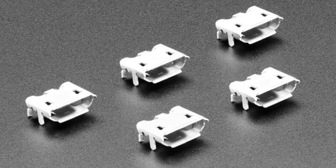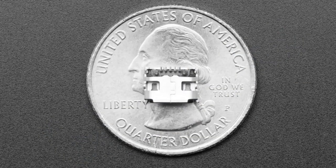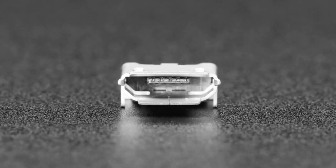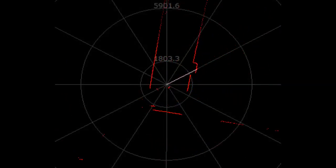You can use these in a surface mount process with pick-and-place — just put paste into the through-hole pads and it makes it super secure. I give Phil the boards after we make them with these micro USB jacks and say "Can you try prying this off?" He tries and it's hard — he usually destroys the board before the connector comes off, the PCB delaminates. These are Lady Ada approved micro USB connectors. Having a good through-hole SMT micro USB connector really makes your project work out well.